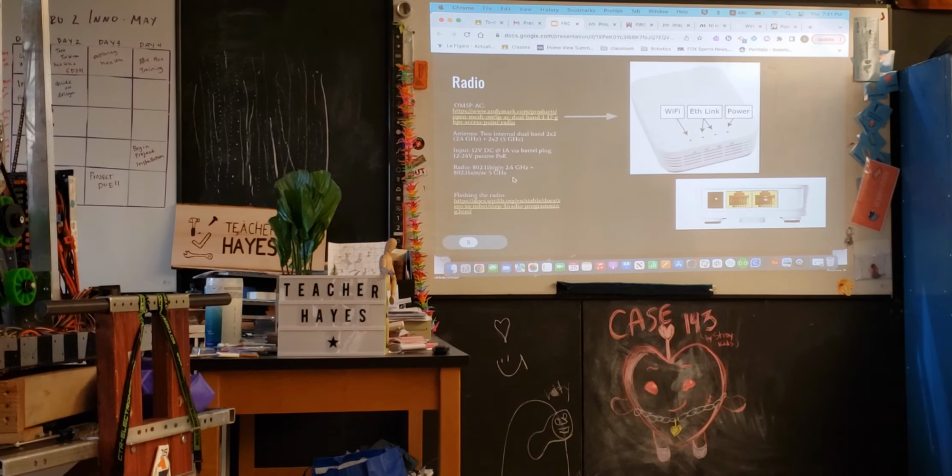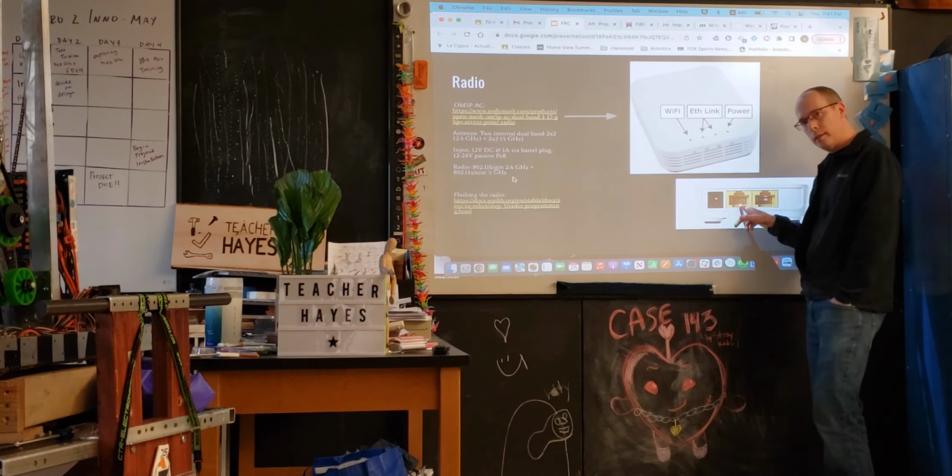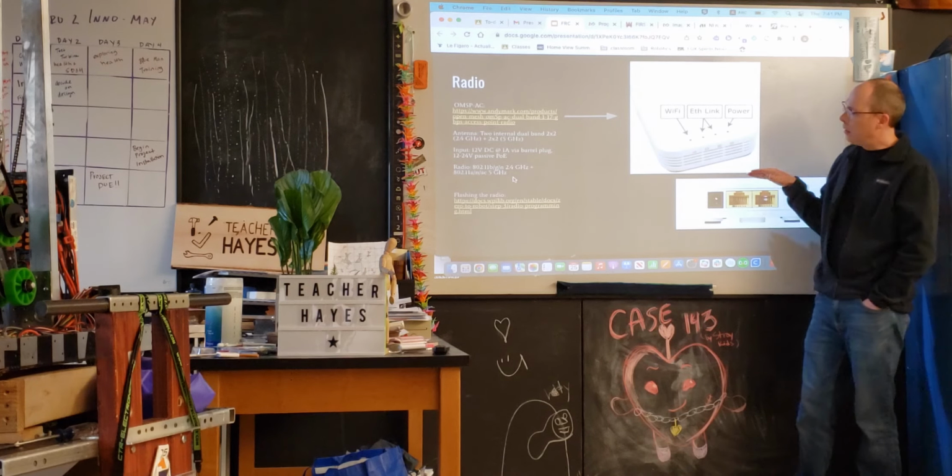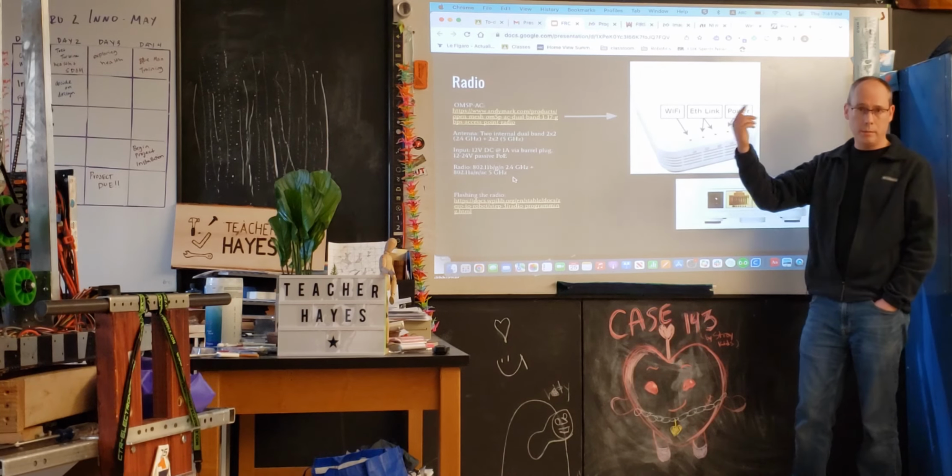Once the computer connects to the radio, does it send information to the radio that then sends it to the RoboRio? The radio access point is really only at layer 2 and 3. What that means is your application is communicating from the driver station to the program that's on the RoboRio. In between, this is terminating an Ethernet signal and then resending a radio signal. That's called layer 2, and on top of that would be layer 3, which is basically packets that go end-to-end.